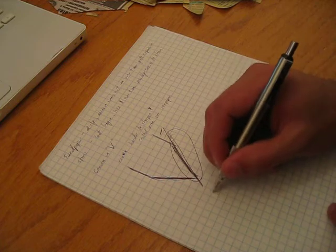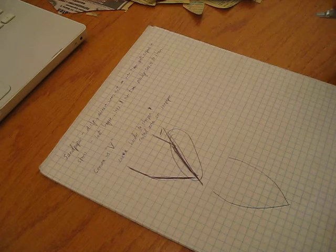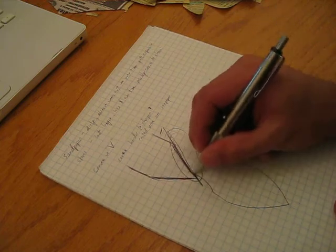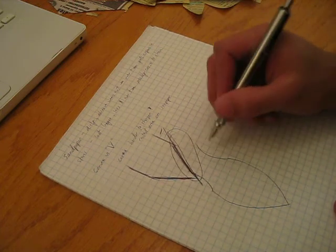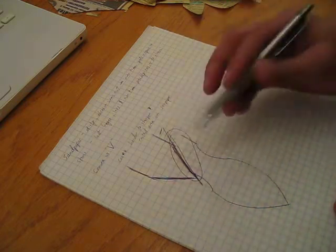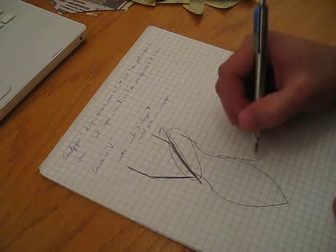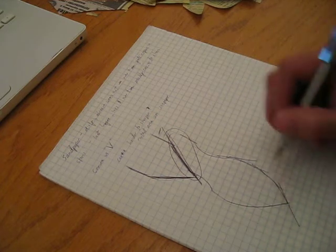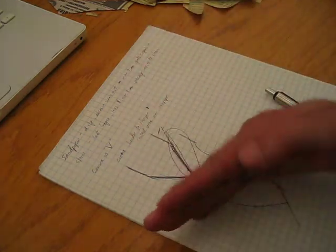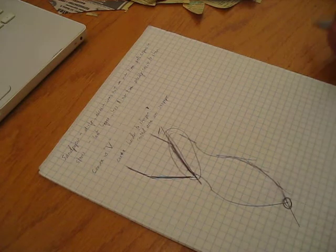With a convex, on the other hand, let's say your knife edge is curved — obviously exaggerated. When you're laying the knife flat, it's on the shoulder here. Then you start to roll it. On a convex, because it's round and has a radius, you have a bunch of tangent lines — here, here, here, here. There's almost an infinite number of edges because it's round; it could just keep rocking. And it's harder to tell that you're on the actual cutting edge.